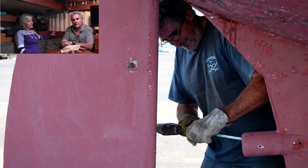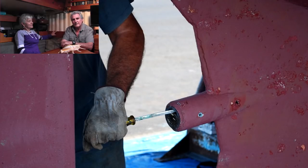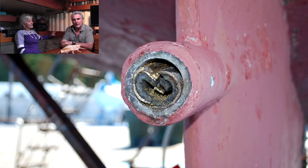removing the Cutless bearing. Now, the most common way is you go from inside and pound the Cutless bearing from inside outward. We couldn't do that because I couldn't pull the shaft all the way out, just enough to clear the Cutless bearing, so I couldn't pound it out. So the next thing was I took a Sawzall, and I made 2 cuts in the Cutless bearing, as the picture shows, in 2 places opposite of each other, and then with a screwdriver and a sledgehammer I collapsed the Cutless bearing. And then I took channel locks and pulled the Cutless bearing out.